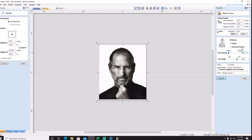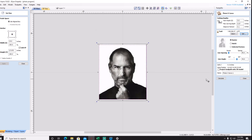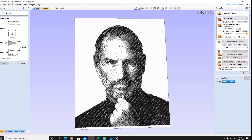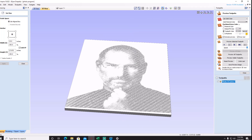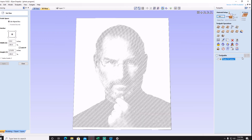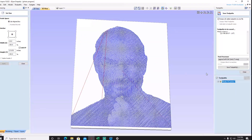I'm setting density to 90%, point-zero-seven max carving depth, and point-one step of retract. I think I can run it a little bit faster but that's not a big deal — all the settings are available right there. I'm doing a 45-degree line angle and 90% density. I don't like to use color too much because it messes me up, but if you take off the color you can get a different feel for it. Looks like it's going to be about 42 minutes long on my CNC — not too bad for a two-foot by 30-inch photo.